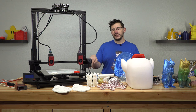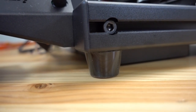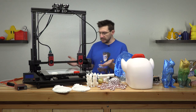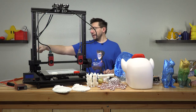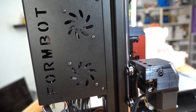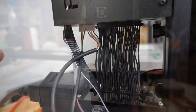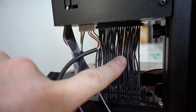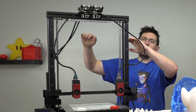To talk a little further about the machine: the bottom has four rubber feet that keep it in place and reduce vibrations while printing — they're useful. The extrusions — I believe they're 40x40 — they're huge, heavy metal extrusions, and I think that's a value right there. These are linear guides. The LCD screen is up there with a little knob, and then cables go back to this box right here. This is where you insert the SD card and where you attach USB if you need to do a firmware update. This is also where this extraordinary self-made ribbon cable exists between the power supply and the box.